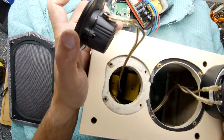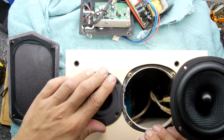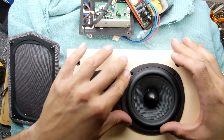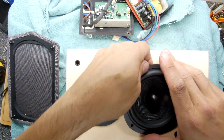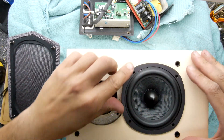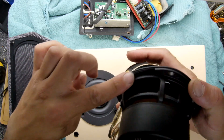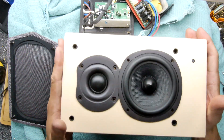There's quite a big crossover board in there with plenty of gubbins. I'm trying to push the woofer back in but it wasn't seating properly — that's the real reason I loosened everything up. It's definitely not sitting flush now, and it has to sit flush to seal properly. After a moment I realised — what a numpty — there's a cutout here that I wasn't aligning with a corresponding feature. Once I lined it up correctly it seated perfectly. I'll just pop in those screws now.